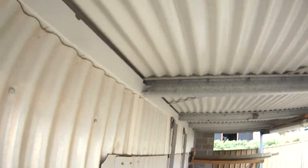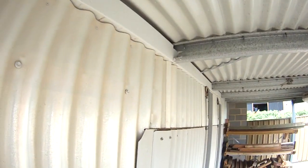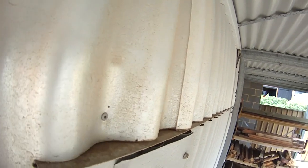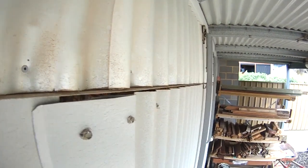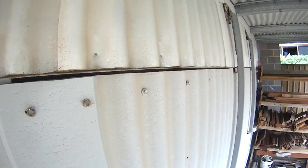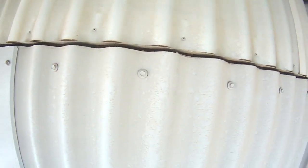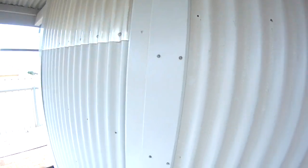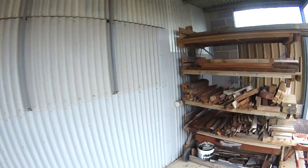The last thing: if this didn't have a roof above it, you'd need to worry about rain getting in. That's why there's a drip rail right here — you could probably do without it, but it made a nice finish to this corrugated iron. I used flashing on the outside edge to keep the wind out as best I could. It's nowhere near airtight, but it's good enough.